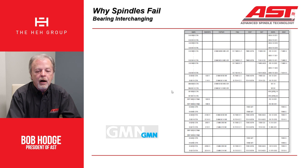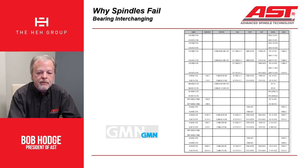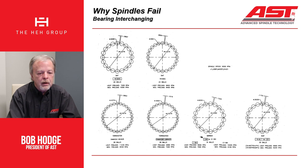However, there are quite a lot of differences between one bearing to the next in terms of internal geometry, in terms of architecture. Just because they have a series — is it a large ball bearing? Is it an intermediate ball? Is it a small ball? Is it 17 degree contact angle? Is it 15 degree contact angle? We go through in quite a lot of detail. Even though the bearing can fit in the same envelope — it's still an ISO 10, a 70 series bearing — look at the difference in ball complements. The size of the ball and the number of balls has a dramatic impact on the speed capability and the load carrying capacity of the spindle.